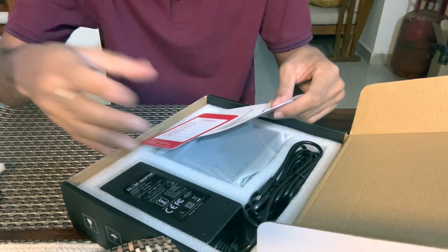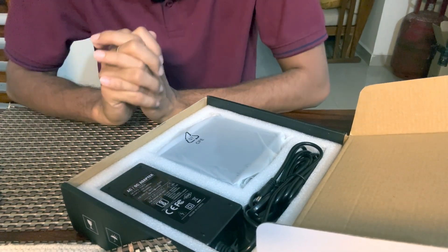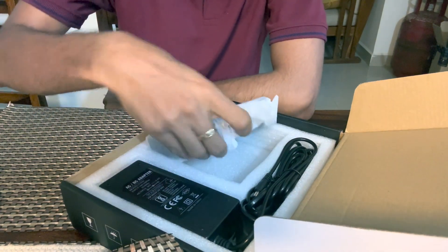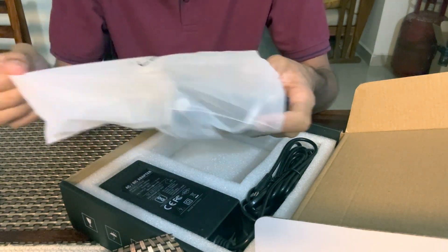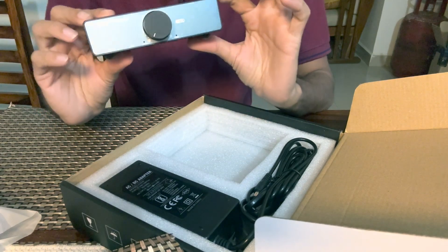This is something where you can actually change op-amps to your liking to tailor the sound — though this is all audiophile snake oil. Of course, there are people with sensitive enough hearing to tell the difference between op-amp chips, for example the TL072 or the 2144, but that's not for me. I will not pretend — I cannot make out the difference, at least.